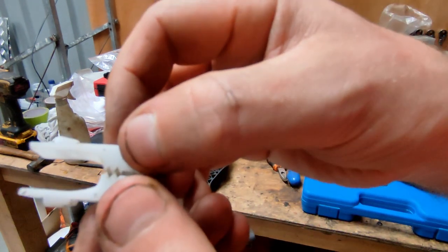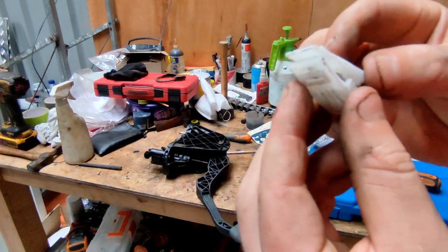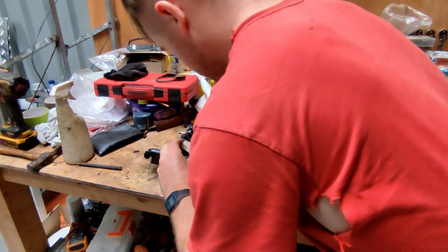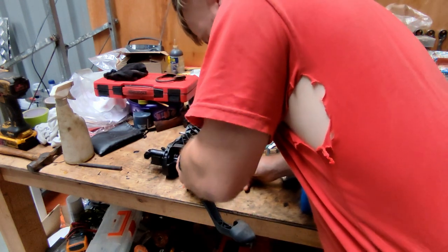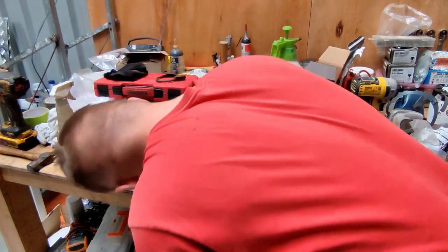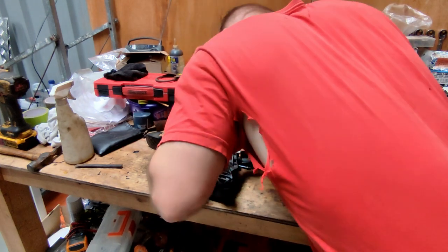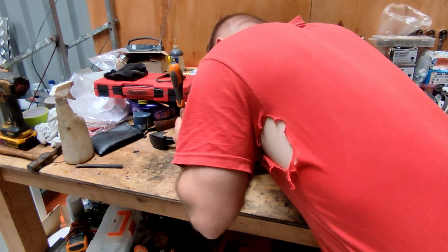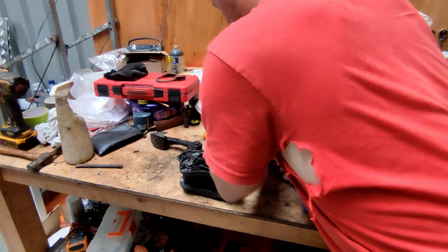These two white pieces — they look like teeth that mesh together, and inside there's a recess for a ball. That's the ball at the end of the master cylinder rod. Make sure this is lined up properly on the right teeth, then slide them in loosely — very loosely. We need this to be out of the way so that it can open up to be able to get the ball itself located in properly.